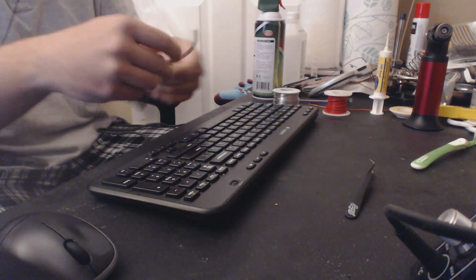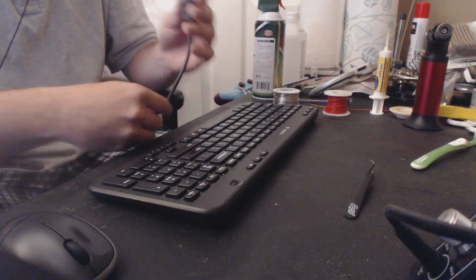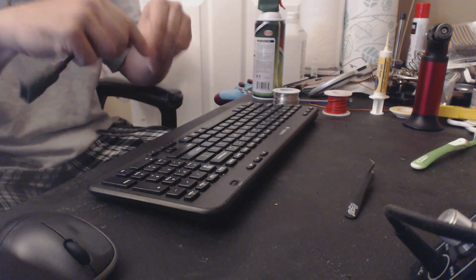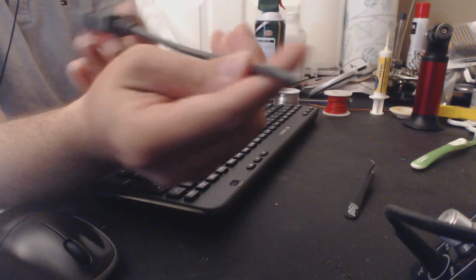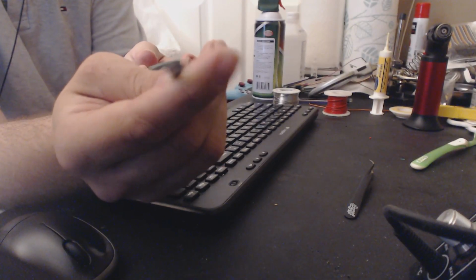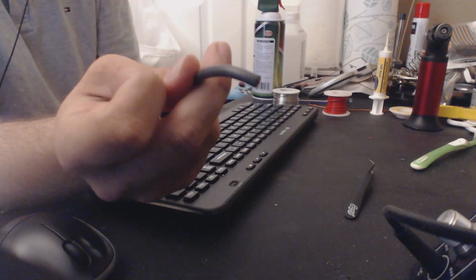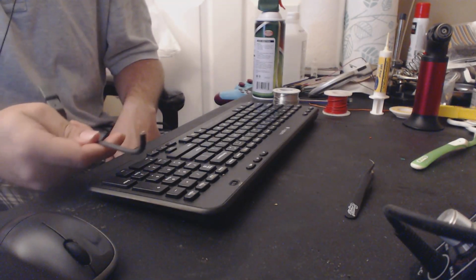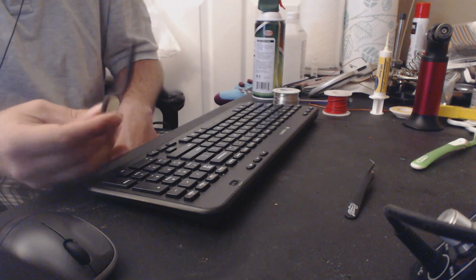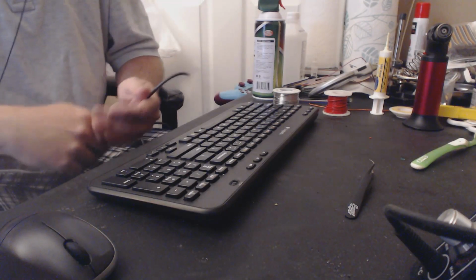So now the next step is we need to pin out this cable. What I mean by that is that we know there are pins 1 through 9 on the female and male end of the Saturn controller extension, but now that we've cut it, you're going to see all these wires inside of the cable. A lot of people will use standard practices for any kind of electronics cabling, like black for ground and red for 3.3 volts, stuff like that. But especially where a lot of these controllers are coming from China, you can't be guaranteed of that. And especially for a controller like this that's not very common, you're not really going to have a standard to look at. So what we need to do is use a continuity meter and pin out all 9 wires inside of this cable. So we're going to go and do that.